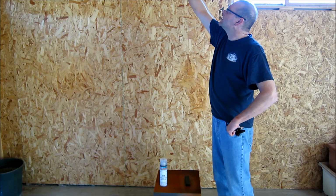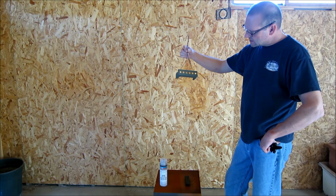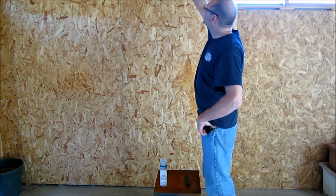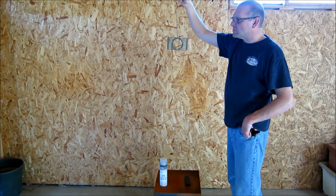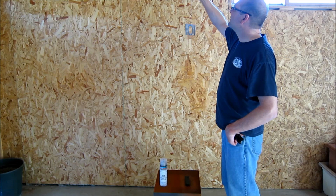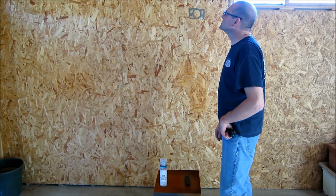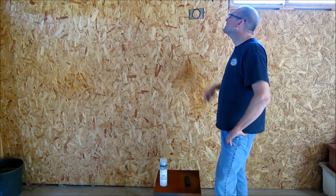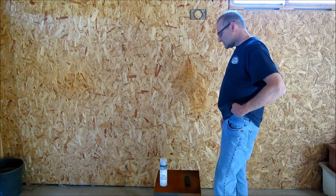The fan controller is actually a 6-channel. And I did finish that in the same process, scuffing, surface cleaner. So, that's done there. Etch primer. Another piece of Dazmode's puzzle. Of course, same steps for the surface preparation. I love that primer out of that can. It looks really good, and the coat that it puts on is just amazing. As far as the bond that it creates, acid etch, it's pretty awesome. You can't go wrong with etch primer if you have bare metal. I've also heard of guys using it on plastic, but I'm not going to do that since I do have my own plastic primer.